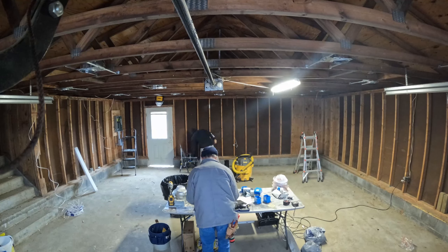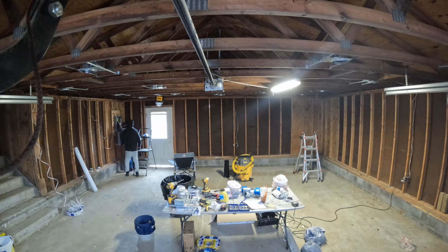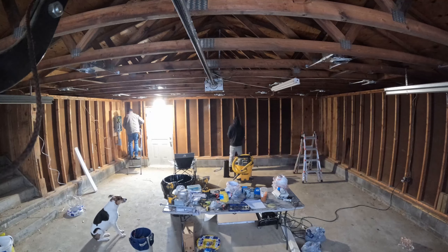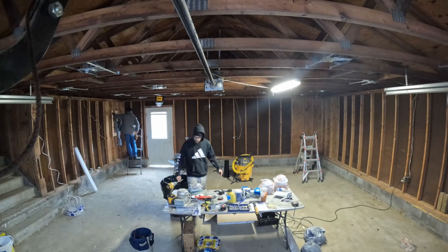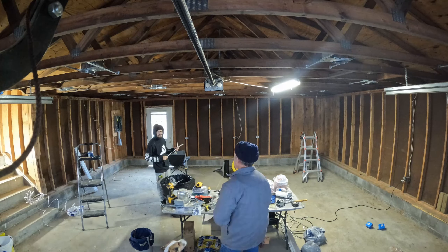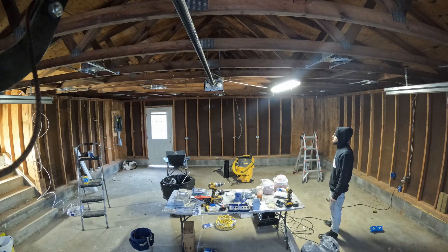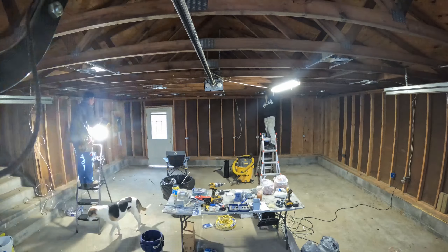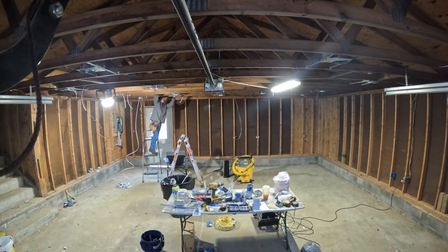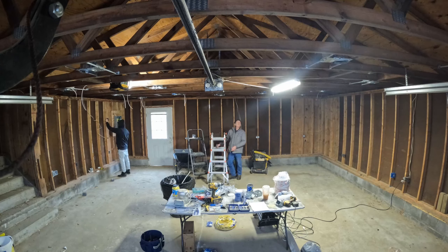The breaker box here — so let's talk a little bit about breakers. There are so many different types of breakers. If you need a 20 amp, or in this case a 15 amp breaker, there are different brands of boxes. I made the mistake of taking a breaker from downstairs in the box I had laying around, took it to Lowe's, got the same type, brought it upstairs, realized the box is a different brand — downstairs is GE, up here in the garage is Square D. Then we found out Square D makes two subtypes. So we went back to Lowe's again and now we can finally install the breakers. Watch videos beforehand, make sure for your specific box you're getting the correct breaker. You'll save yourself a lot of trouble.